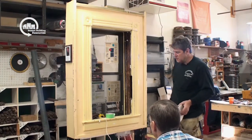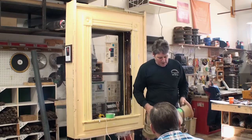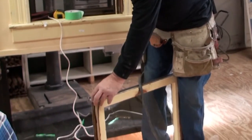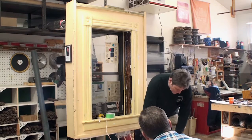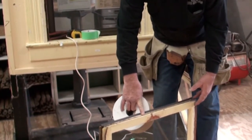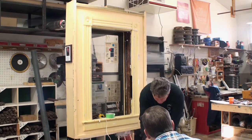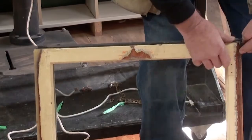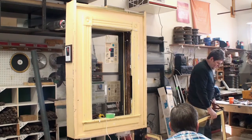What you would do on the top of the top window is you could cut a kerf — I usually just use a table saw, or a router table sometimes. If you don't feel like cutting a kerf, they make a material that's basically the same but has a flat end with adhesive — you peel it off and put it across. On the top window, you don't even need to staple it, you just put it on. Or you can cut a kerf, and this little wriggler part goes right into the kerf. That takes care of the top of the top window.